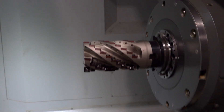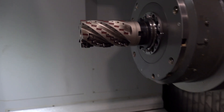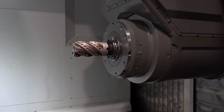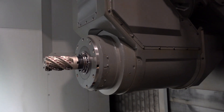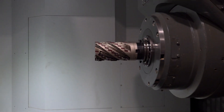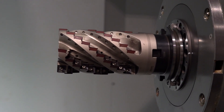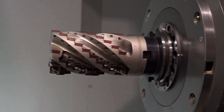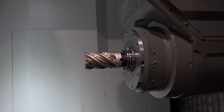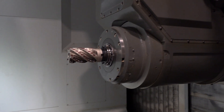What we're looking at here is our 635 5-axis — a titanium aerospace structural machine. The way it's spec'd out, you can get it with an 8,000 RPM spindle or a 15,000 RPM spindle. The tool itself that we have on there is an ISCAR cutter that we're looking to hog some material out with — really looking forward to making it rain. When people come to visit this event on September 14th and 15th, will this machine be running a demo for that?